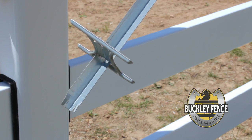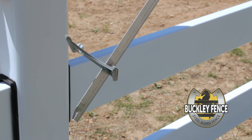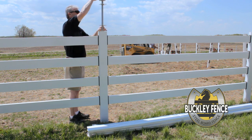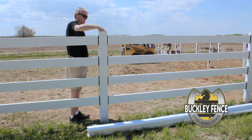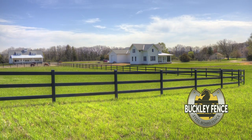The lock spacer has an angled iron backbone with welded-on butterfly stampings that contact the rail centers. The lock spacer drops in from the top of the post after the rails are in, and rests on the top rail for perfect positioning. There is one butterfly stamping for each rail line.